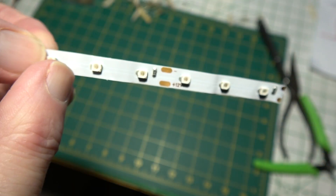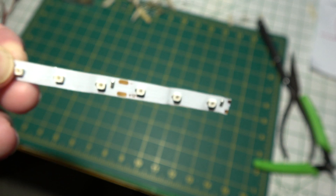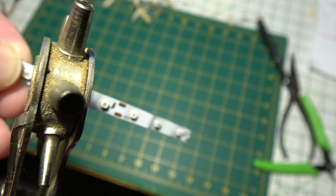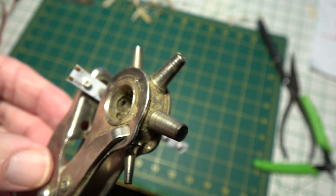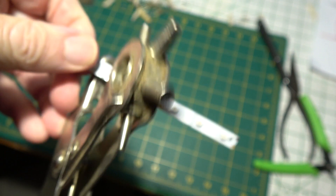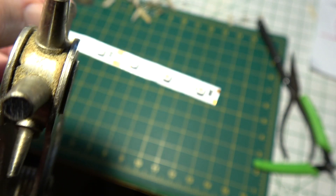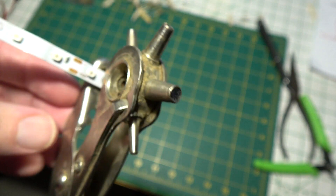The first thing I need to do is separate the LEDs by cutting the center connector between them. The easiest way I found is to use one of these leather punches — put it right over the center edge, it doesn't have to be exact because we're not going to solder to it, then just press and cut a hole there. You can clean it up with an exacto blade. The sticky paper on the back holds it together; I do that in two places for the two clusters.